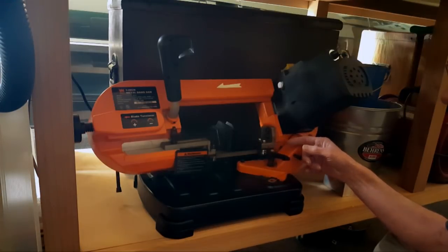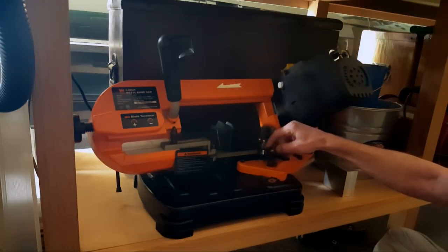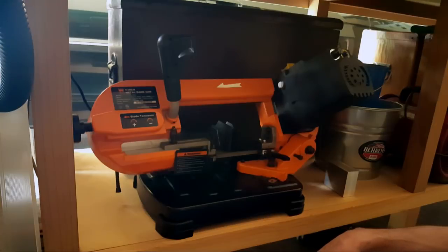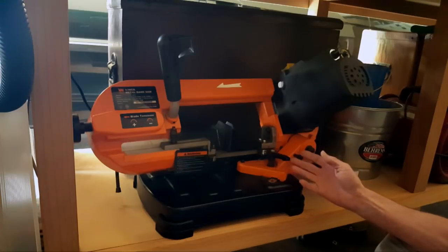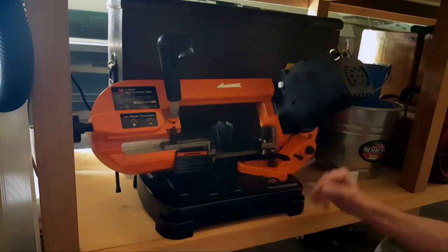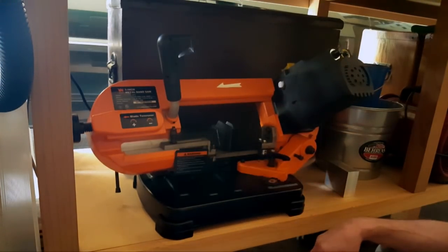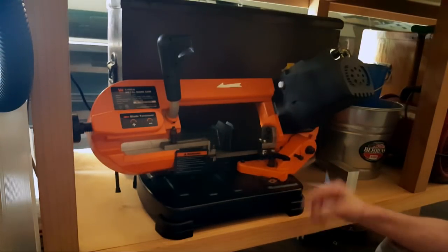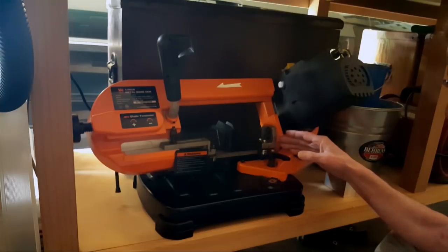I can't remember how much I went through, but another thing that got me is I guess I pulled the whole thing out, wasn't paying attention to the washers. They've got 2 washers on each stack, bearing stack, and the washers are different thicknesses. If you don't pay attention to the stacks when you're putting it back together, you can wind up in a situation where now the bottom bearing is on the teeth itself. So the next thing I know is I'm sitting here with calipers measuring stack thicknesses to get them all the same height again, put it back together.